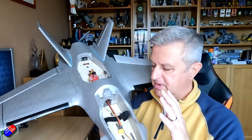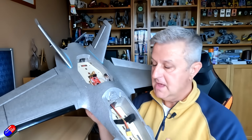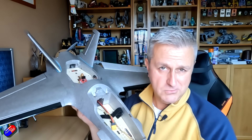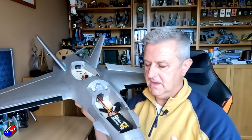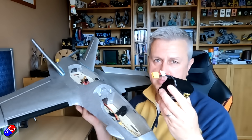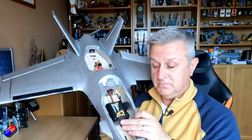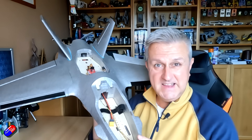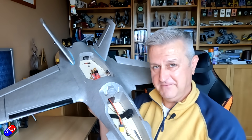I'm going to build this out and play with iNav over the next couple of days, stick a Walksnail unit on the nose, and configure it as I normally do for auto launch. The 8x4 prop at the back is still going to be fine for hand launching in my opinion. I'm going to be flying this on a 6S battery - when I put it in there's absolutely loads of room and I have no problem getting center of gravity with the 400 gram battery sitting about there in the nose. I'll see what performance is like with lithium-ion, and if needed I'll go to LiPo. I'm sure lots of people will start messing around with increasing the pitch on the prop to get even faster flights.